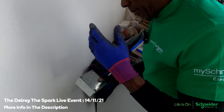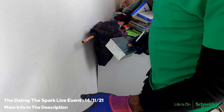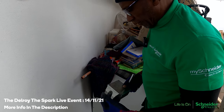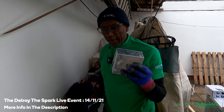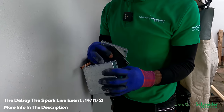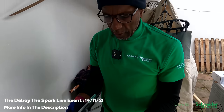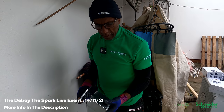I'm going to make the armoured cable into this metal box. It's three core, so the armouring is not being used as the earth — the third wire is going to be the earth. I could make it off into the socket, but that's plastic, and I don't think it's a good thing making off armoured into plastic. This is a 4B2 adaptable box — I've got ones without knockouts, so I drew my own knockouts, which leaves it sealed properly. I've got grommets to put on the front to prevent any moisture getting in.